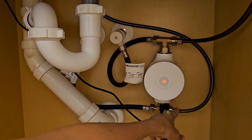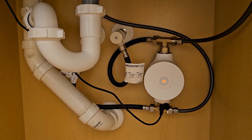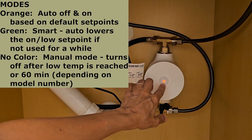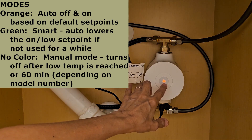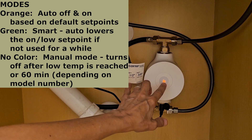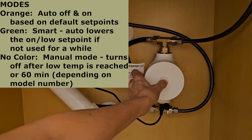The two lines on the right side go up to our faucet. The temperature by default: when the water is 33°C (91.4°F) it will come on, and when the water reaches 38°C (100.4°F) it will turn back off. There are three modes: orange means it's on all the time — if it gets too cold it comes back on, and when it hits the right temperature it turns back off.